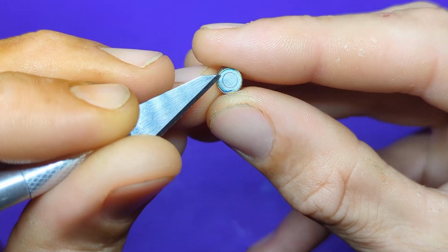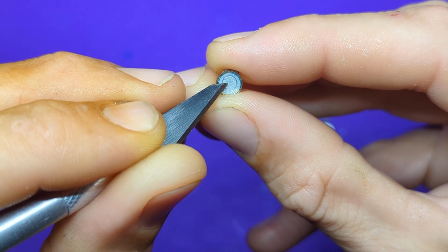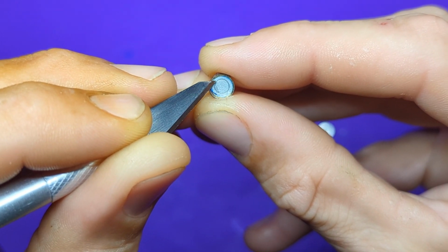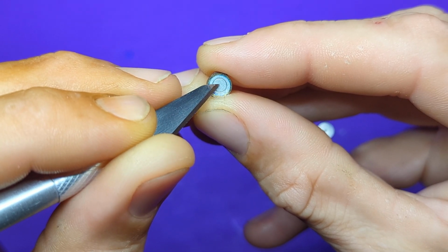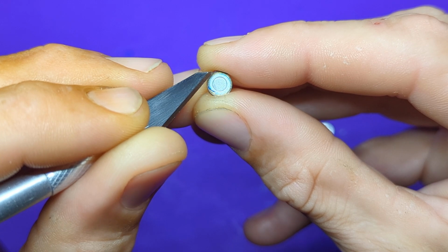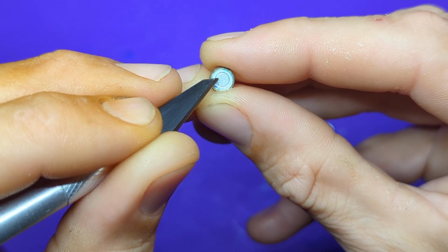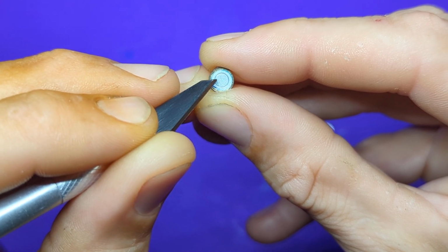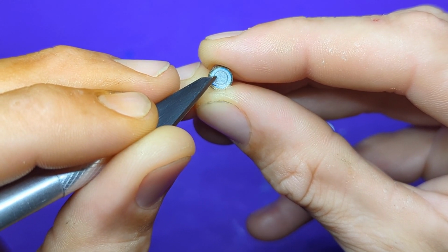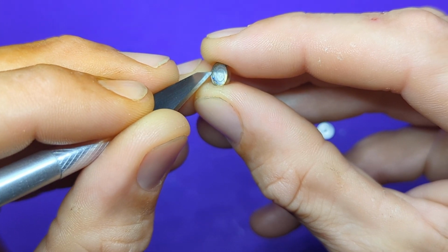I think in a future revision, they should have a gap between the two magnets. You know, maybe have the north be like half the size of this one and leave more of a gap. Because a lot of people don't realize, but magnets, their poles stretch out from the magnet, and they travel around. But anyway, the greatest point of intensity as far as magnetic pull goes, or magnetic force, is not always right next to the magnet. It's usually a little distance away, and especially when you use metal, or ferrous metal.